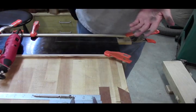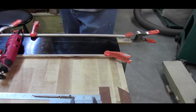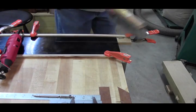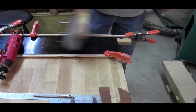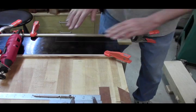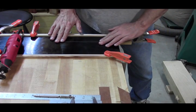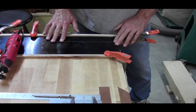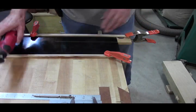I'm going to stop and let it cool for just a second — it's just barely hot, but rather than keep building heat, I'll let that cool down a little bit. If you take light passes, it really doesn't heat up the plate hardly at all. I took a couple of heavier passes there, but the heat dissipates out into the plate pretty quickly, so I can start again and finish this up.